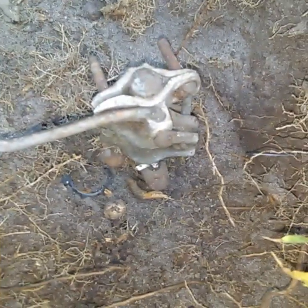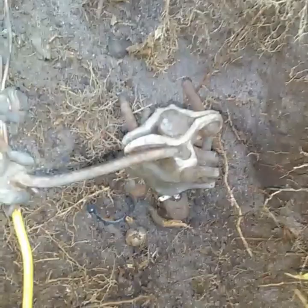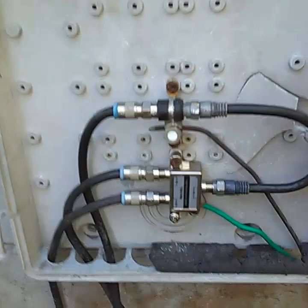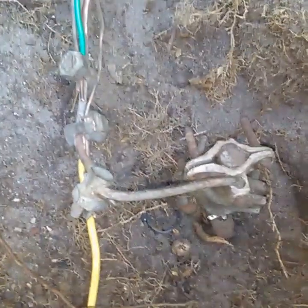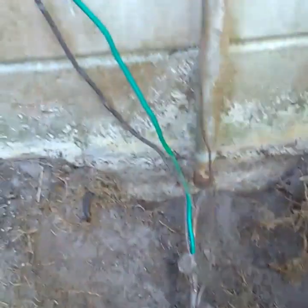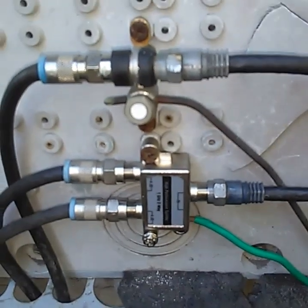If you don't have a ground rod in an older house, you may be grounded to a water pipe. Some places it may be grounded to a wellhead. You have to investigate carefully, and if you don't have a clear idea what you're doing, consult somebody who does — it's very important. The reason I'm showing you this is because I had a lightning strike, and if I had not grounded my antenna properly, I'd be out buying a new TV and maybe rebuilding the living room from a fire. But the ground system worked well. A path of least resistance is better than no path.